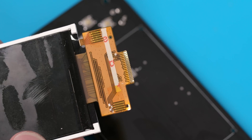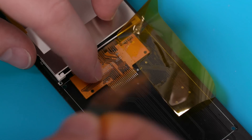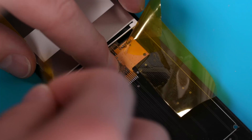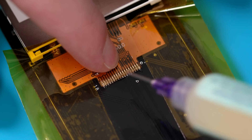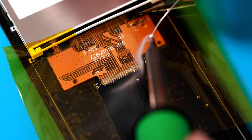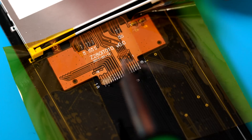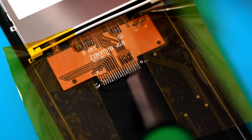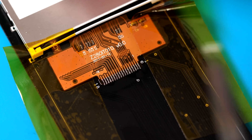Speaking of flux, it's going to be our friend in the next step, which as far as I'm concerned is basically impossible without it. The display connector is a ribbon cable, and those are apparently very hard to solder — but not with flux. All you have to do is line the cable up with the pads on the board and tape it down in place, making sure it is lined up about perfectly. Cover the cable in a generous amount of flux — quite a lot — and then apply solder directly to the tip of the soldering iron. Then drag the soldering iron across the display connector covered in flux. The flux will magically suck that solder directly onto the solder joints, creating the perfect connection with no bridging, no cold joints. I freaking love flux!